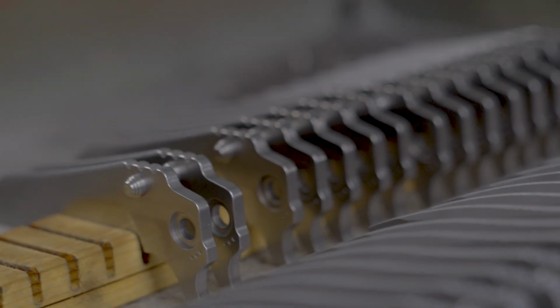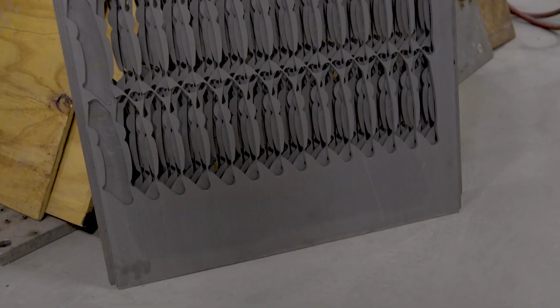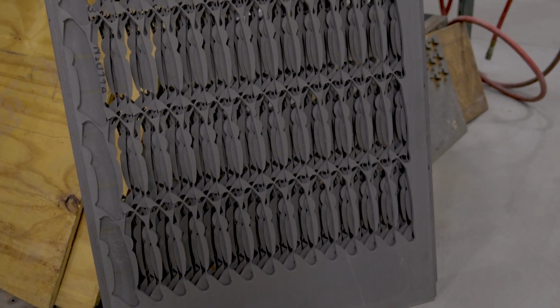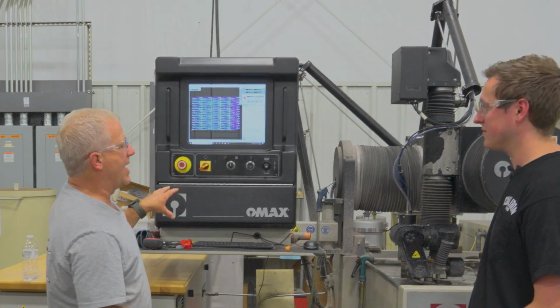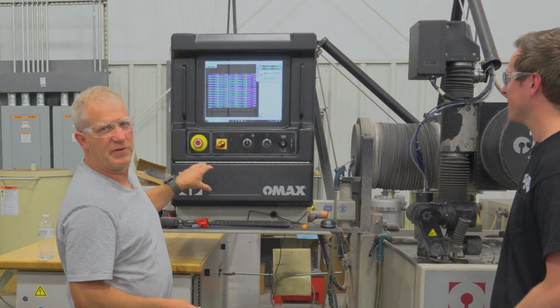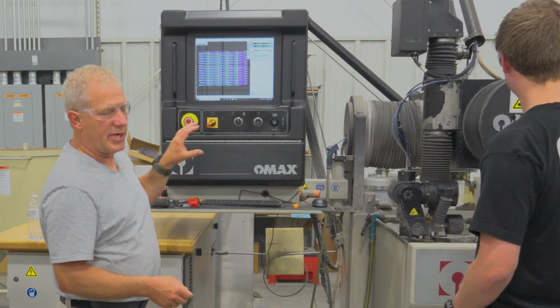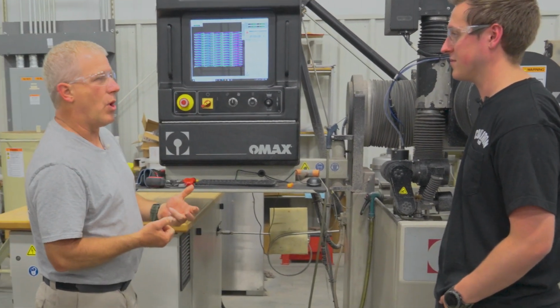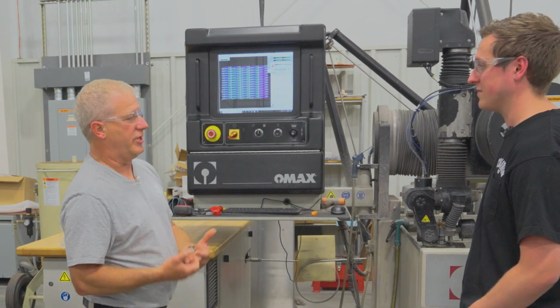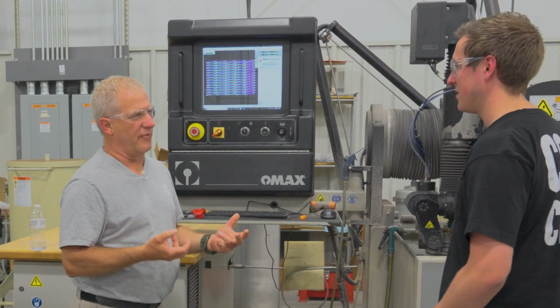So we put a sheet of titanium in. Those are blades. We're putting a sheet of steel, like 20CV, in the water jet on the table, and we're working at about 53,000 PSI. The water's not doing the cutting. They call it an abrasive water jet machine, because it's garnet, but it's really sand. It's really purified sand.